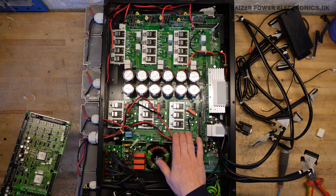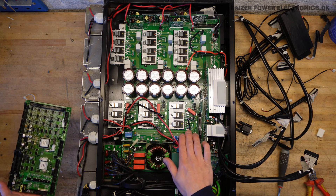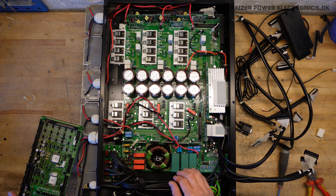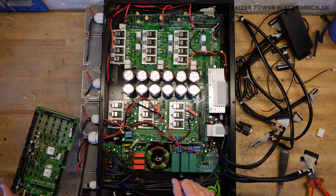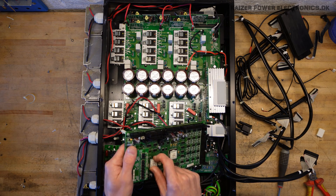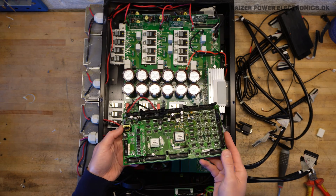Those... oh, is it 264? Something like that — MAX packages. Not your common TO-247, but the large version of those. Very nice. And a fast diode sitting here. As for the controller, it seems to have this kind of little ceramic heat sink glued on.